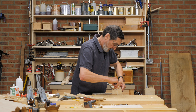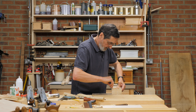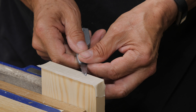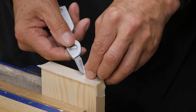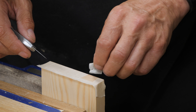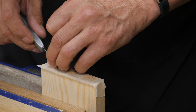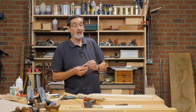You're also cutting the surface of the tape, and I'll show you what that does. Now we can lift off the tape, and that leaves the exact recess outlined in the end grain. You can cut down the side of the tape just as you would the knife wall, and it gives you the exact location of the dovetail, clearly visible.